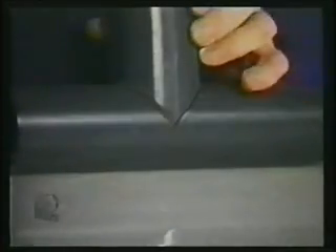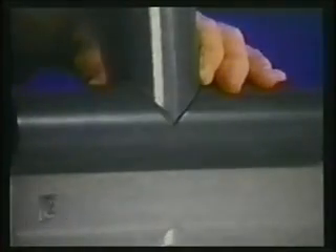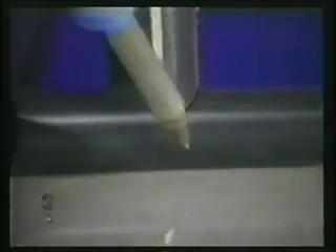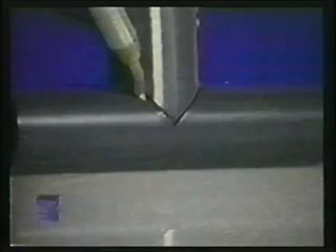When welding a mitered joint, be sure the pieces you are about to join are prepped and all edges beveled to fit as snugly as possible. After you have placed the pieces together using your tacking procedure, tack all sides. Note the continuous tack going across all open seams to assure proper alignment.